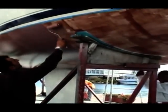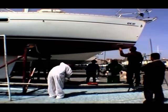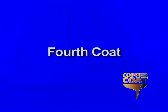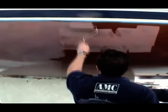As with most painting, for a seamless finish, always try to keep a wetted edge. As the coating's thickness builds, the gel coat becomes barely visible and the patchy appearance lessens. Occasionally, the treatment can look complete after just three coats, when in fact a fourth is required. Usually, the treatment is completed with a fourth coat. By this stage, the coating appears thick, glossy and deeply copper rich. While four coats are normally sufficient, it's imperative that all the supplied product is used. If any goods are left over after four coats, this just indicates that each coat has been applied slightly thinner than usual. In such an event, simply continue to apply additional coats to ensure the correct overall thickness.